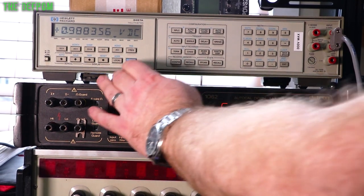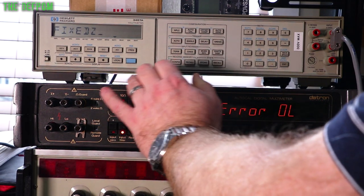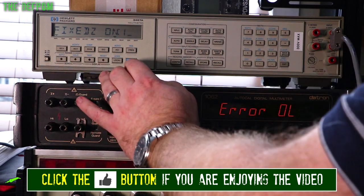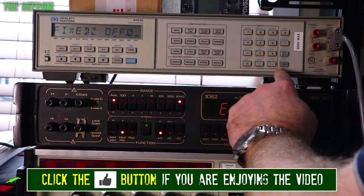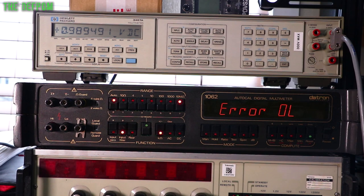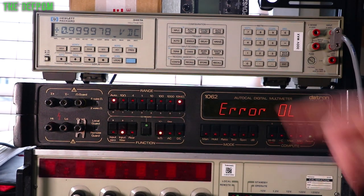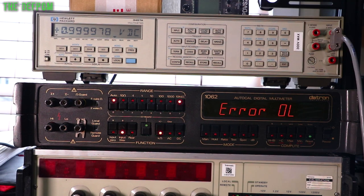Now if we come over there, turn the filter back on again, rather. So it goes back to gigohms. Sorry, that's what I'm trying to do. Go back to gigohms and refilter that. Alright, so we're back up here. So this one's obviously tuned very slightly lower than the other one. Not much in it. That's basically 1 volt coming out with 10 volts going in. Okay, 10 to 1 still. This is a 1 megohm board compared to a 10 megohm board.